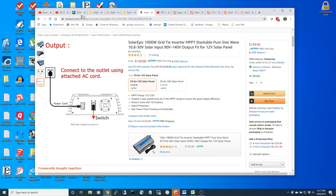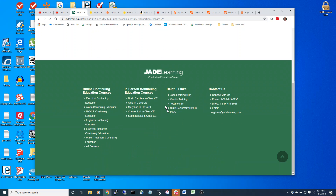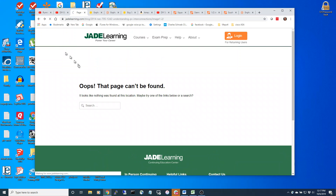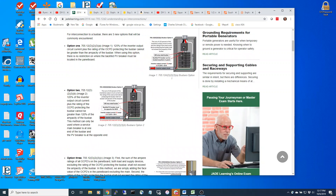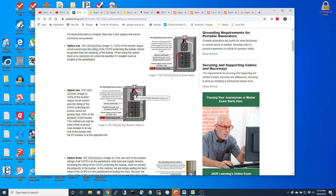So we've covered that the Amazon solution doesn't provide correct distribution between line one and line two, and it tends to overheat - so a thousand watts really isn't a thousand watts. You can find solutions online for how to properly connect your inverter into the panel, but the cheap Amazon one is only going to give you line one or the other. You'd have to run two microinverters to actually cover all your loads in your house.